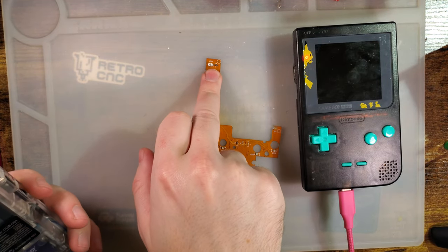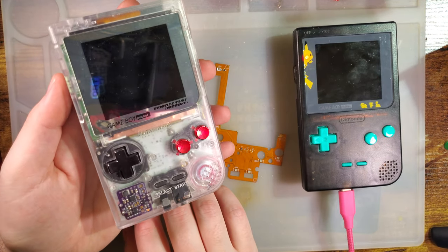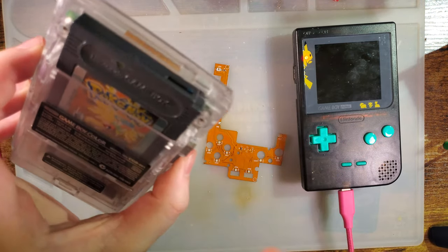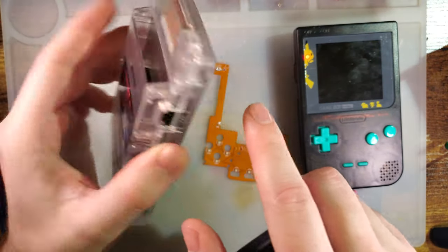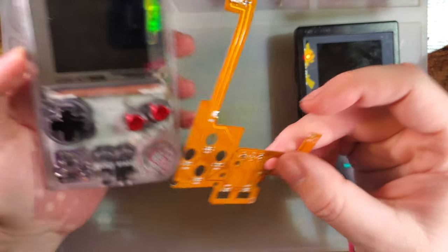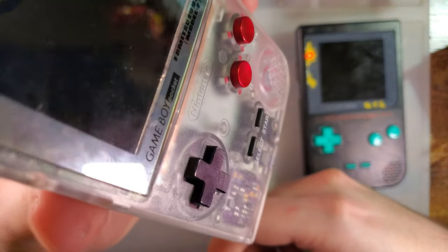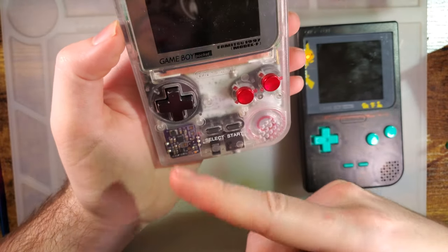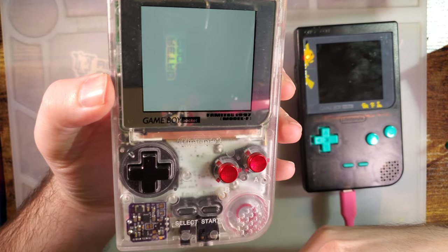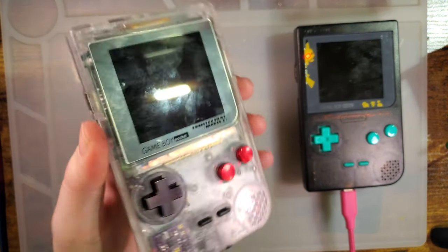The LED on this ribbon does make it pretty appealing to solder into something like a pocket color that I don't have an LED in, because the Game Boy Color LED position just didn't line up with the pocket. The easiest solution was to just remove the LED entirely, but this ribbon would line up where I had to solder it in. The only problem is this console has some pretty great buttons in it, and I don't want to downgrade the buttons. So we're not going to be using this console — we will use the Game Boy Pocket as a donor, not the modified Game Boy Color.